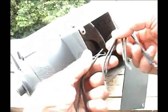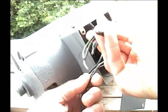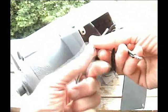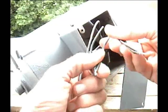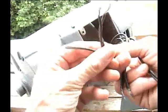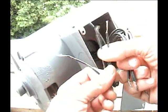I've hooked it up as you would for a 460-volt feed, as shown on the label. So what we have here is: 5 connects to 8, 6 connects to 9, 4 connects to 7 — that's these three pairs right here. Then you'll have three individual wires: 1, 2, and 3.